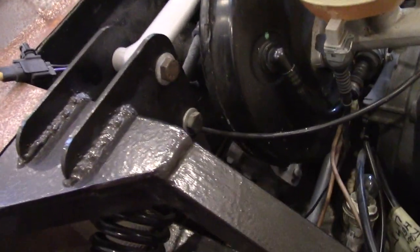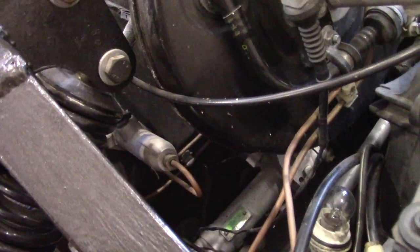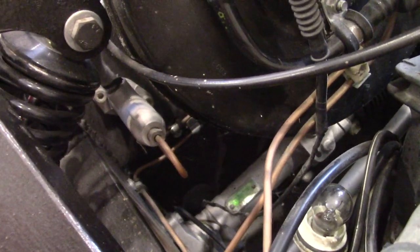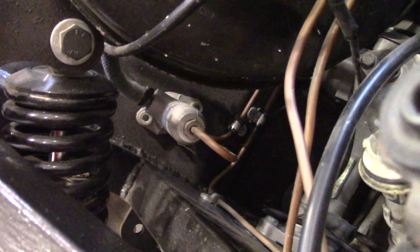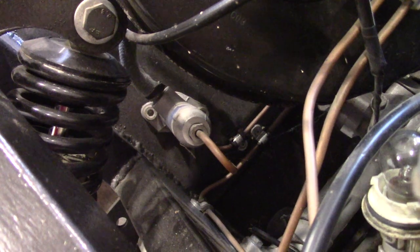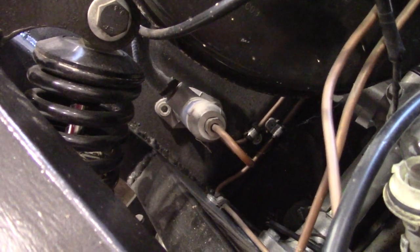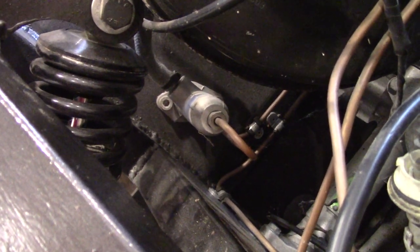While I was developing this, I had no way of testing it until I actually bolted the master cylinder to the slave cylinder with the clutch in place. So I had to take a bit of a gamble and dropped the master cylinder by two inches to get my clearance. Unfortunately, that has compromised the pivot, and now that pedal is just too stiff for my liking.